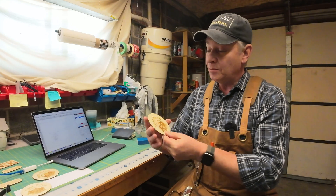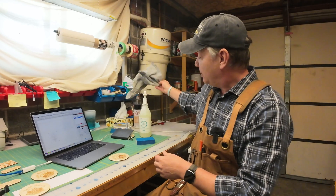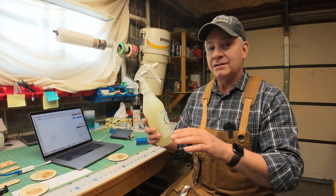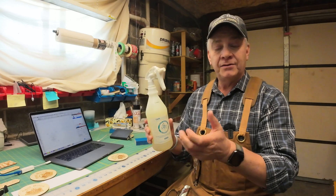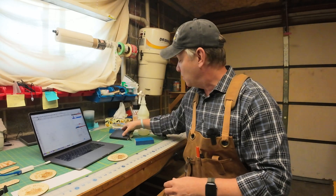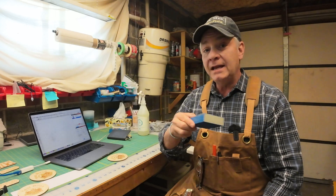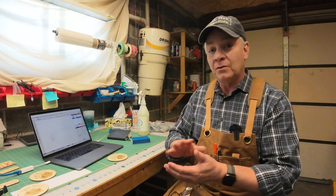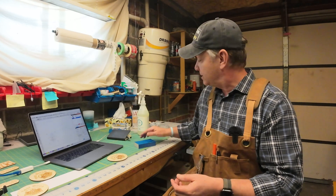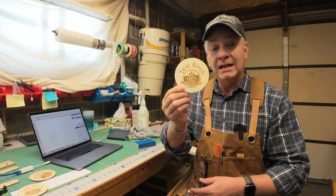When the piece is done, in most cases I had virtually no scoring anywhere, and you might get the odd little bit of residue. I did try this stuff called Laser Clean Plus, which is supposed to be for wood — it wasn't bad but didn't do an excellent job, and you have to wait for the piece to dry after wiping it down. What worked best was just a simple 220 grit sanding pad — a nice light sanding, that's all it took. If you have an air compressor you can blow it off and wipe it down; otherwise just a quick sand around the edges and wipe with a damp rag, and it came out nice and clean.